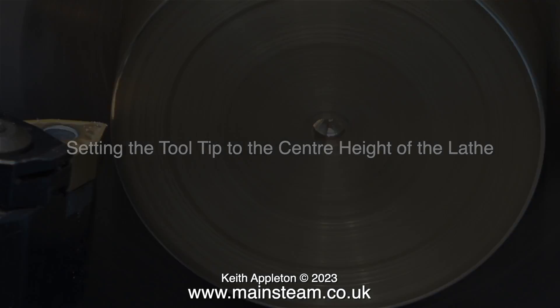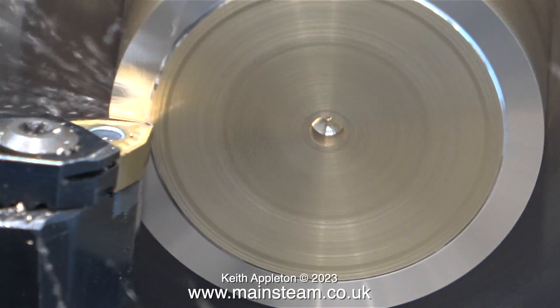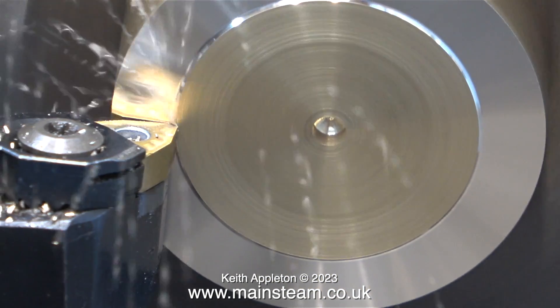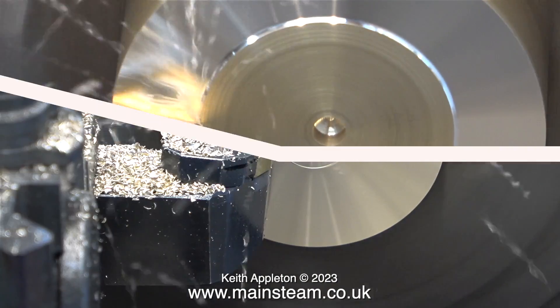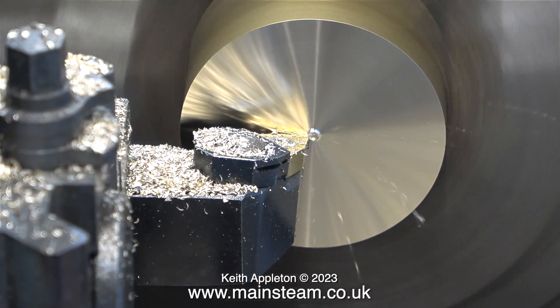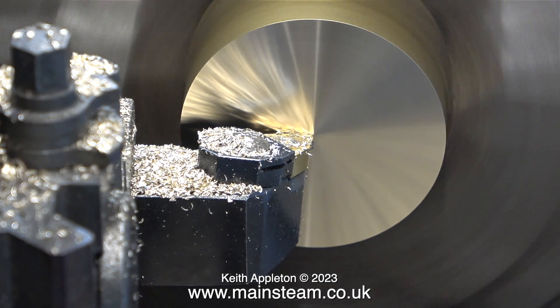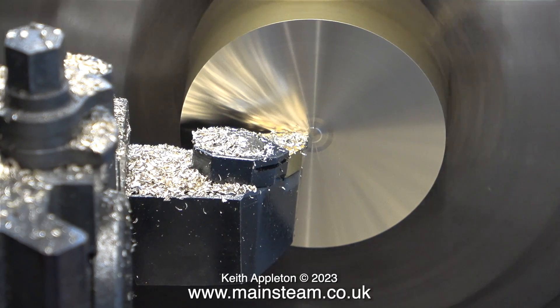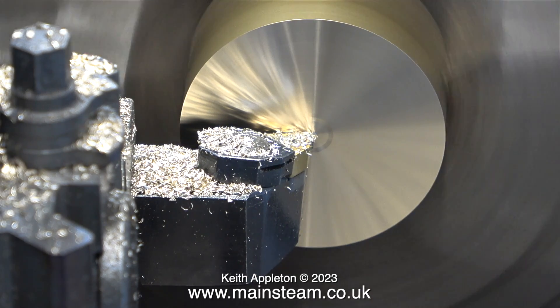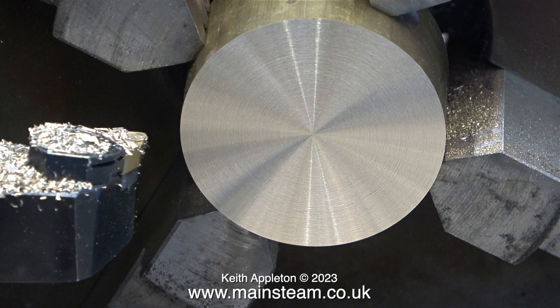It's very important to set the tool tip to the centre height of the lathe, and there are many different ways to do this. What I decided to do was machine this piece of brass that's been annoying me for ages — I want to get rid of the hole drilled in the middle of it. You don't have to set the tool's centre height this way; you can use a centre fitted in the chuck and just line the tool up with the point of the centre, or line it up with a centre fitted in the tailstock. Initially I set the tool to centre height by eye and it was actually somewhere near, but it wasn't near enough. I made some adjustments to the tool holder in the tool post and got it almost perfect.